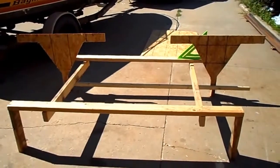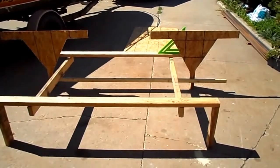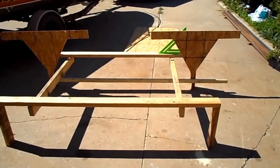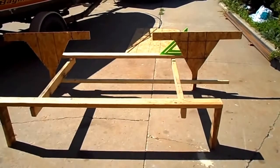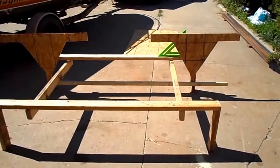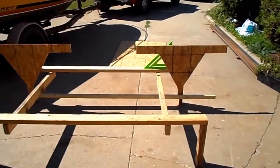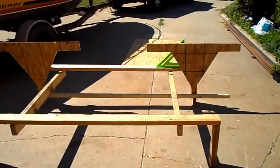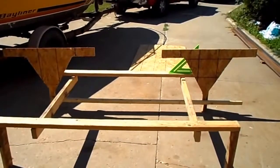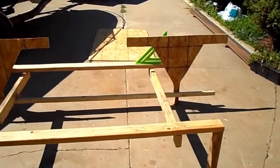Now there's a couple ways you can make a rack. You can mount them all solid if you want, or if you want them to track the sun, you're gonna have to worry about wind. If you put 4 together and make the whole big panel track, you're gonna have a problem with wind ripping them off your roof or wherever you have them mounted. So to get around that, I will have them mounted individually, tracking the sun.